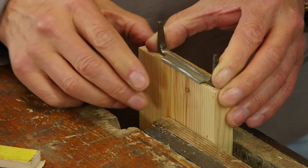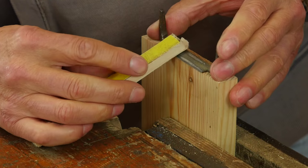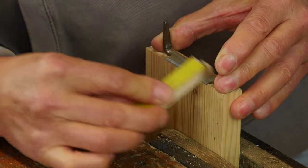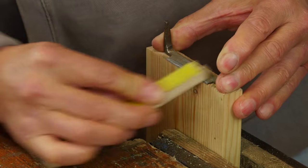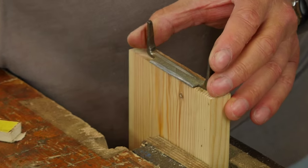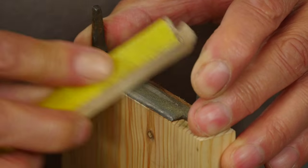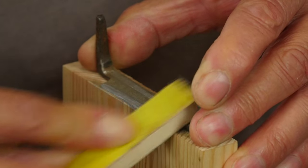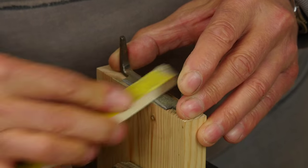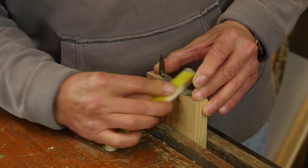I can remove this and come higher in the vice to change the bevel angle. There — now I'm right on that front edge and I've created a slight camber on there, which I think is a great bevel to have on a spokeshave anyway. I've reached the front edge, so I'm on the very front of the bevel now. I work across the whole bevel. This side is higher than this side, so I'll spend a little more time here — going to a fresher grit to take that corner down so it's nice and even along the back edge.